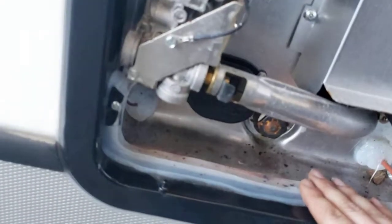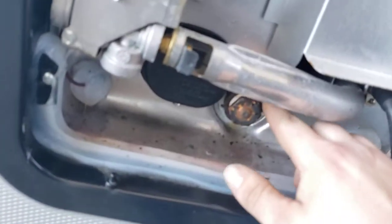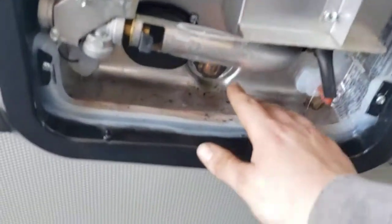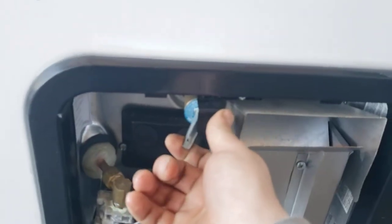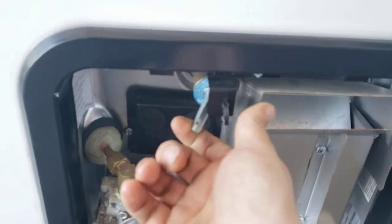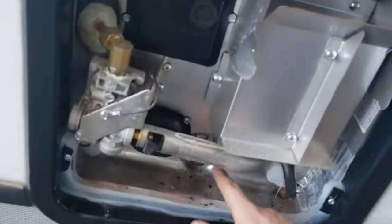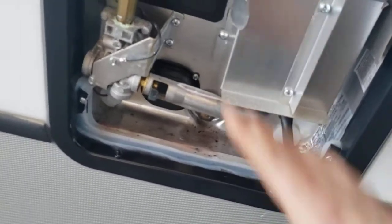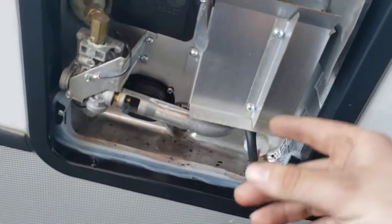The water heater is super simple to use — it's being tested right now and works fine. To drain it, pull the drain plug; the socket size is an inch and a sixteenth. Before you pull that plug, crack your pressure relief valve — air or water will come out, and once it stops, snap it closed, then pull the plug. If you neglect to do that first, you're going to get a hot bath from the heat, or a regular bath from the pressure that's in there regardless of whether you've turned the water heater on.